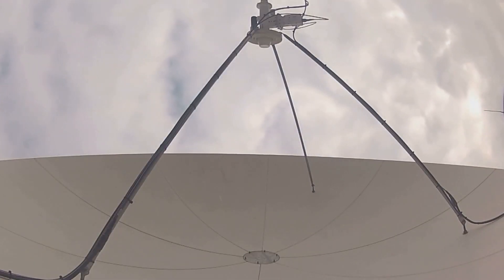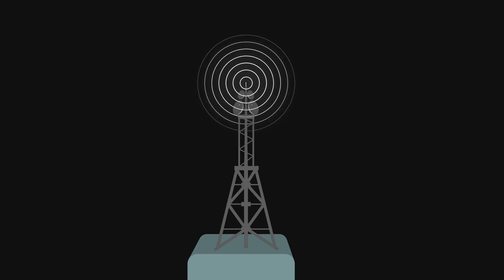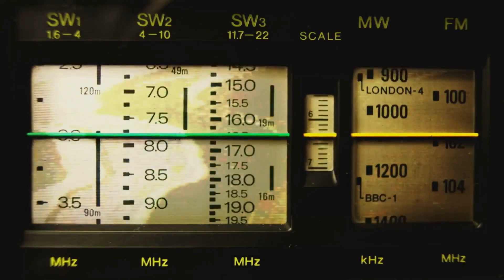So how does this help in measuring distance? When the continuous wave bounces back from the surface of the liquid or solid, it carries with it the imprint of the changing frequencies. The sensor then captures this returned wave and analyzes the frequency shift — that is, the difference between the frequency of the wave it sent out and the frequency of the wave it received back. This frequency shift is the sensor's secret to calculating distance.